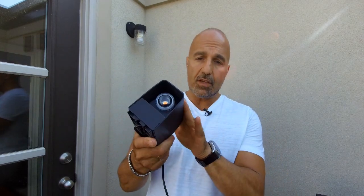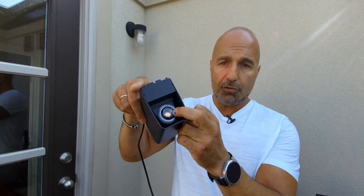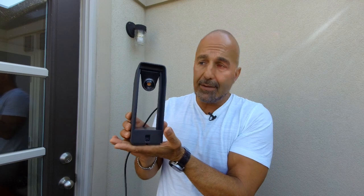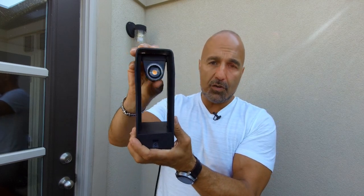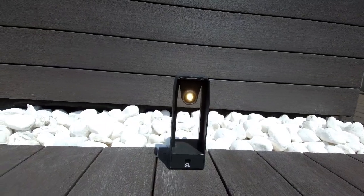On the wall we're putting in wall-mounted fixtures — a vertical directed light with an LED fixture on top and bottom that mounts on the wall and directs light up and down. With landscape lighting you don't want it to hit you in the face; you want indirect spots of light where you don't necessarily see the source. Throughout the rest of the deck I'm using this bollard that sits on the ground. The gimbal inside moves so you can direct light downwards, casting light on the decking and giving you a bit of illumination around the architecture.